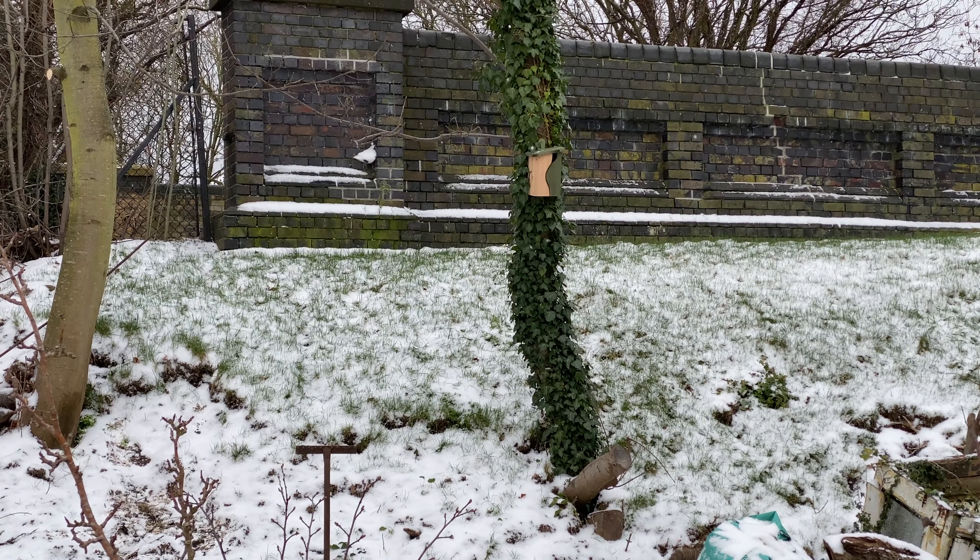I've got the posts in now all the way along the bottom edge of this upper terrace. There you can see the row of posts that I've put in — that's going to form the bottom edge of this upper terrace. These two small top posts are temporary; I've put those in just to indicate it's about a meter wide. This terrace is going to fit in between these trees where I can find spaces between the roots, and it'll run all the way along to the other side.